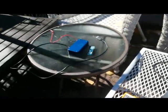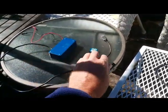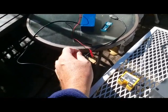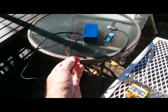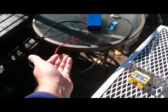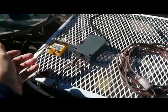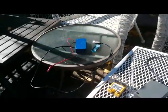The second part to control this: I've got an Arduino powered by USB — just a simple plug. It's programmed similarly to the blink program. It turns on for a few seconds and then turns off for a period of seconds, and it outputs about three and a half volts through these two wires. Connect these two wires to the control wires on the relay and I have an extension cord that can be turned on and off by the controller.